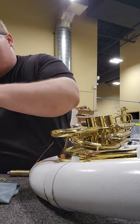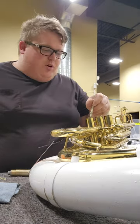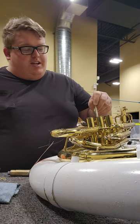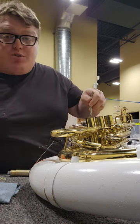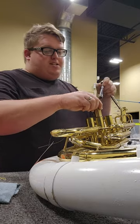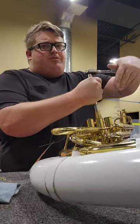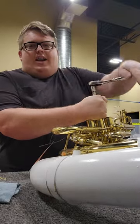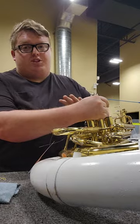We're going to proceed on through with the rest of these valve casings. I'll lubricate both of these. Once I've got it set to one piston, it's pretty reliable that you can leave the setting alone for the other pistons. But you do have to listen to the metal, and if it starts getting overly difficult to turn I'd need to put a torque wrench on this. It would be interesting to measure the ideal rotational torque, but I've just got a feel for it because I've been doing this method for about six years. I know this is about the amount of force it takes to get the valve free without over-expanding the valve casing.